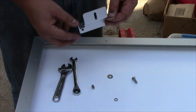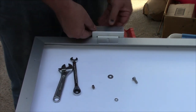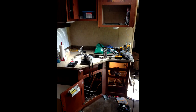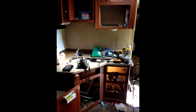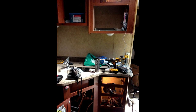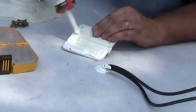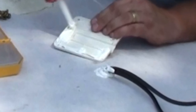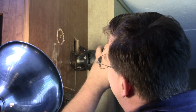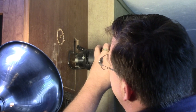Preparing the panels was easy. We installed the panel brackets while still on the ground so the panels would be ready to install once we had them up on the roof. Inside, we disassembled the kitchen cabinetry as needed and removed the microwave to gain access to where we would be installing the controller and running cable. We drilled up through the roof to run the cable down from the panels, and using a Rotozip we cut holes in the cabinet end for the various panels after spending some time deciding on the layout.